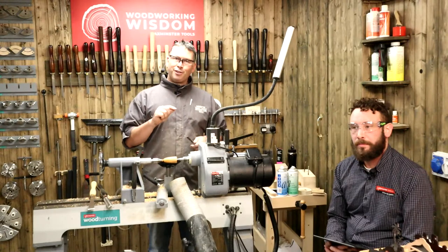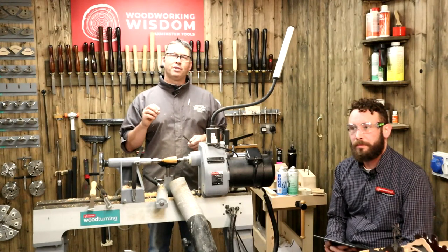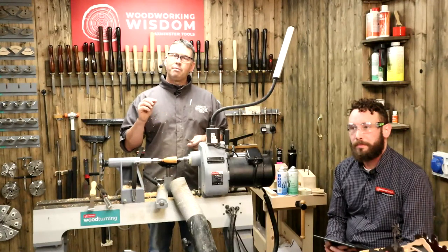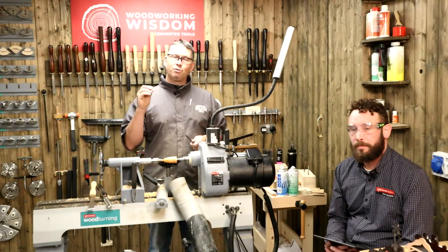Now, I've tried to use sealers before stains. What happens is the stains sit on the surface. The minute you contact them with something, it comes off, and also they don't dry. So, no, you're dead right.